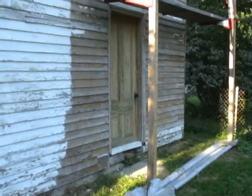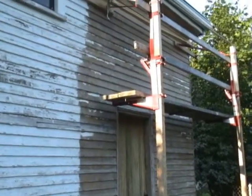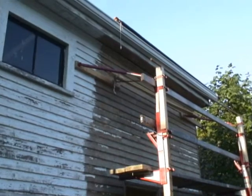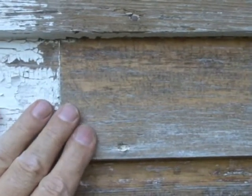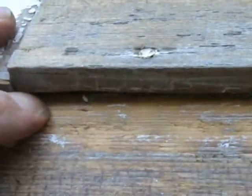We're working on a 10-foot wide section of the wall here. We've removed about 150 square feet of paint, including the cornice with its overhanging soffit and fascia up above. We've removed all of the heavy peeling paint buildup down to bare wood, even paying attention to details like removing all of the paint junk from the joint between the clapboards. That's revealed a very nice old growth tight grain wood surface that's going to hold our new coatings of paint very well.